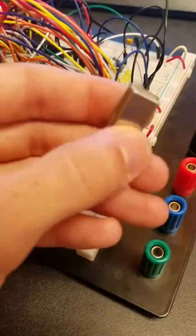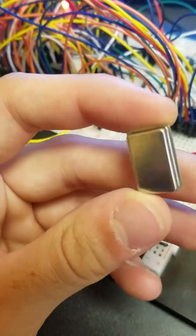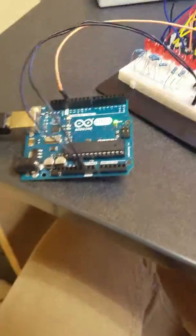Oh, actually, right here I have a 10 megahertz crystal that'll run the Z80 at 10 megahertz, but this simple test program I have would be done in less than a fraction of a second. So I'm using this Arduino with a simple Blink program running at 1 kilohertz to clock the processor.